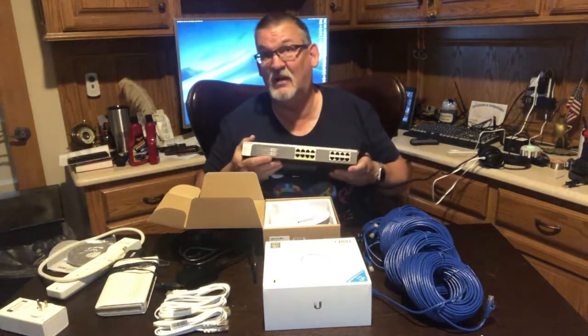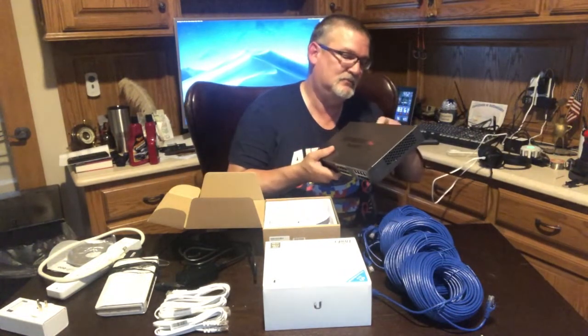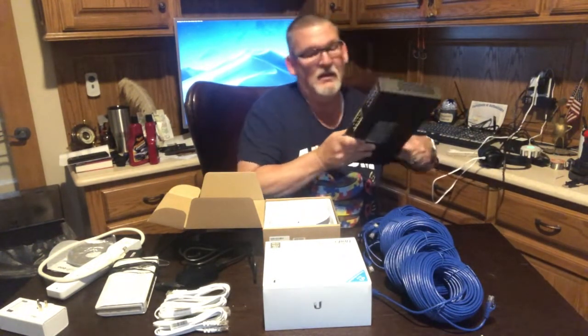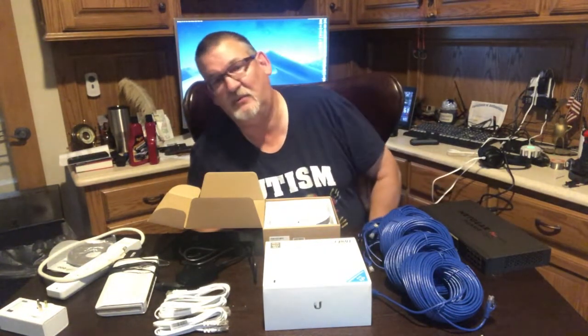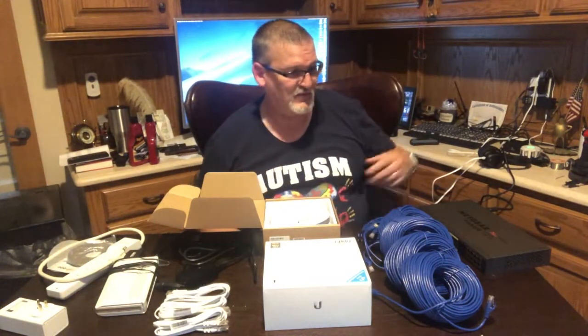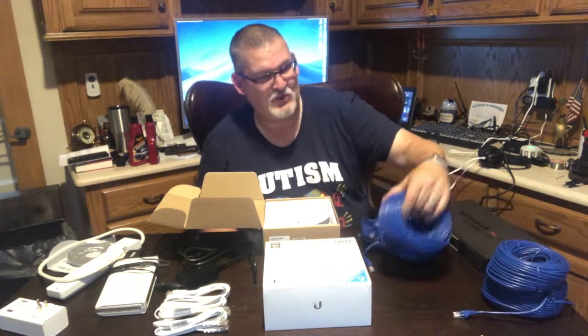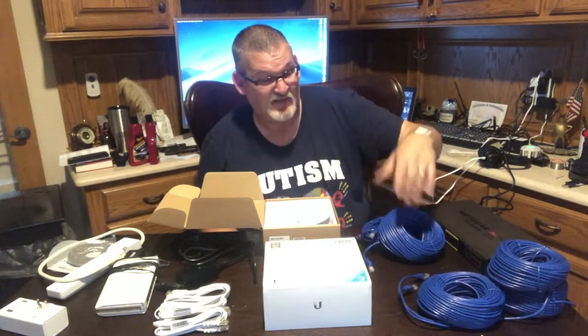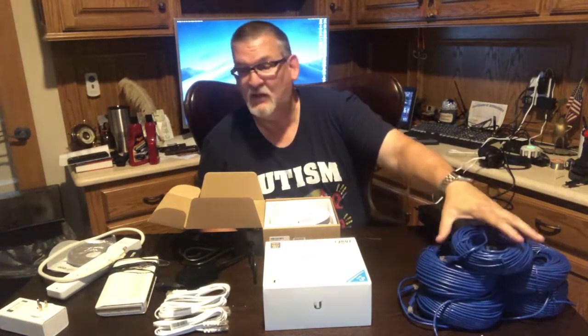They're just gigabit Ethernet. So if I plug this in, I think this thing can be managed, but if you don't manage it, it's just a dumb switch. It'll do exactly what you tell it to do. It'll pass traffic in a single broadcast domain, single VLAN type situation.